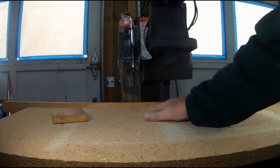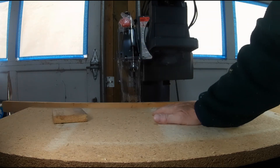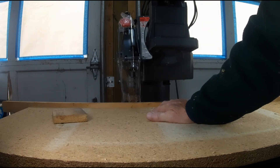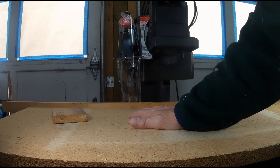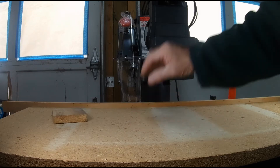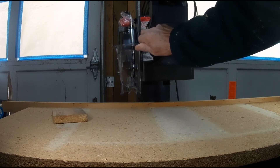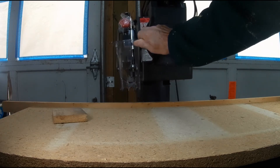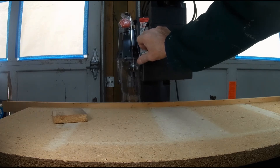When the head is in cross-cut position, if I wanted to bring it forward I would be able to — that's exactly what this guard is for. That little protrusion on the guard is the reason the blade will not come forward. Yet I still see machines where guys have built some kind of dust collection enclosure that takes the safety away. They put the guard on top of whatever they created and the safety feature of the guard is negated. To me that's really irresponsible.